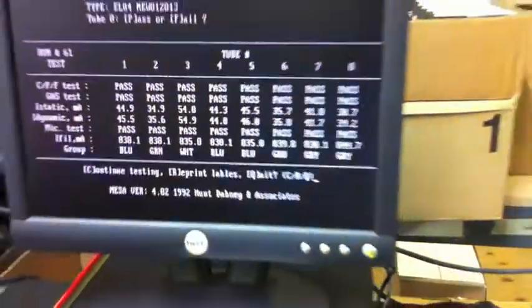The color codes for different matching are listed on the screen and they print out on the printer. We'll go ahead and apply those printouts to the base of the tubes and match the tubes in pairs and package them appropriately, so you can have matched pairs and quartets in your amp.